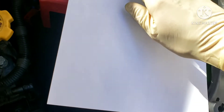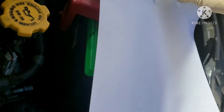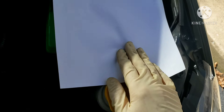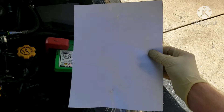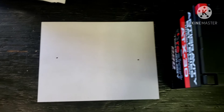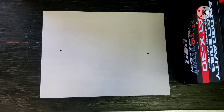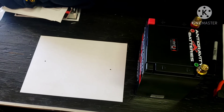What I'm going to do is build a template first to find out where our mounting holes are. I'm going to basically push this on here and make an imprint, then push it on the other side and make an imprint. That way we know exactly how far apart our studs are for the battery hold down. I chased those two mounts onto a sheet of paper — it's not 100% straight, but that's all right. Now we just need to measure the battery and exactly where the restart button is going to be in relation to our battery hold down studs, and we can then design how our hold down is going to go over the battery.